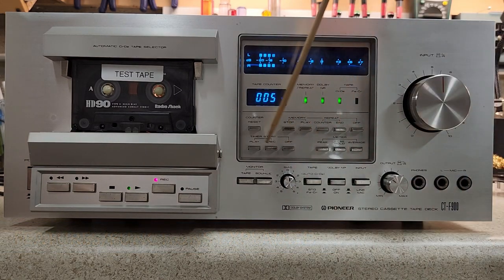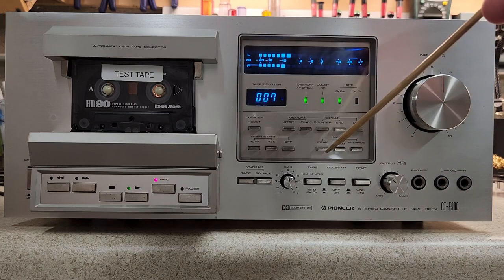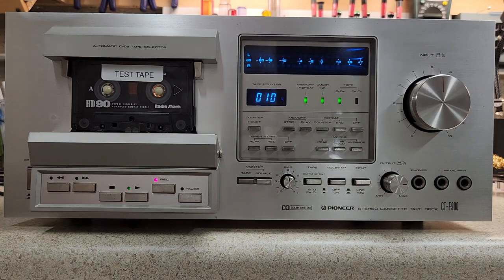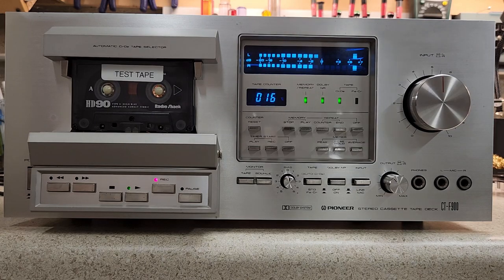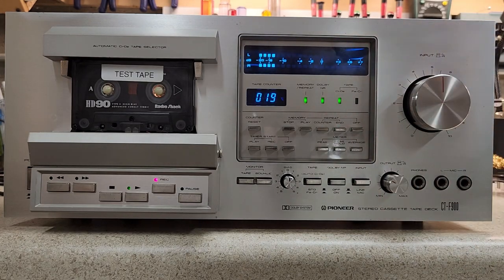You want to make sure you don't have timer start set if you haven't taken your read-write notches out. The meter has multiple modes: average, peak hold — which shows the highest segment heard up to that point in time to help you avoid recording too high and causing distortion — and regular peak. Average flows a little more than peak; peak tends to be a little more jittery.